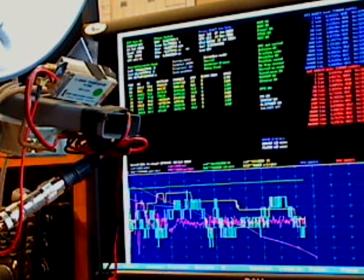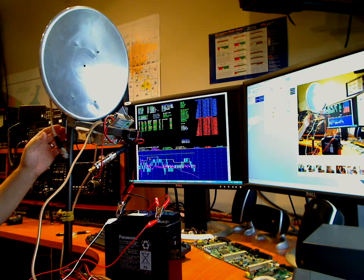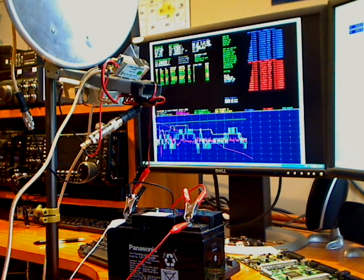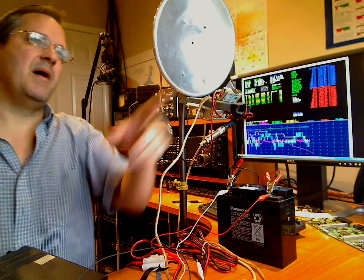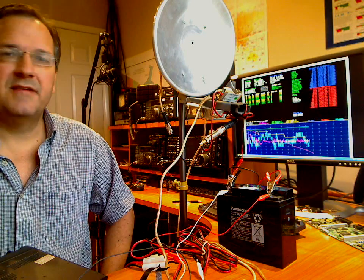That's a little bit about the GPS unit and stability. Let's see if we can hear the beacon. We've got basically a carrier for 30 seconds. That unit there is coming out of this IF unit. This little dish is pointed out my window, hitting the mountains over on the other side — it's about 20 miles across the valley — and picking up the reflection on the beacon that's basically in the backyard, pointed west.